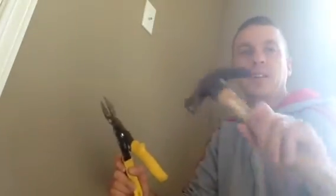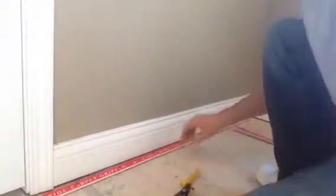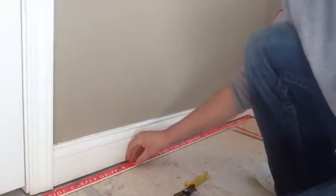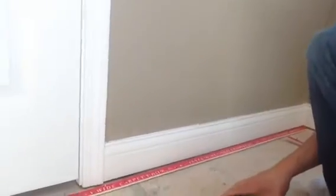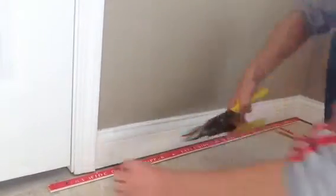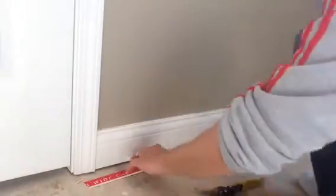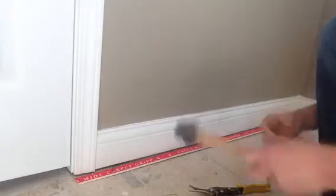You're also going to need a pair of snips and you're going to need a hammer. The tack strip — you want about a finger space from your baseboard. That way you have the room for the carpet to tuck. And if you look at the door there, the door frame goes a little bit extended, so you want to cut it with your snips so it goes wall to wall, leaving roughly a quarter-inch gap between the tack strip and the wall.